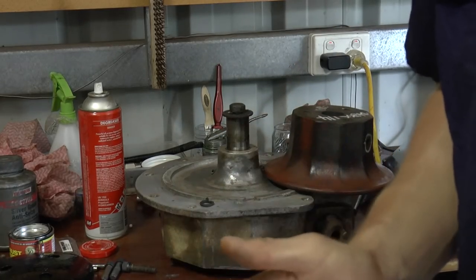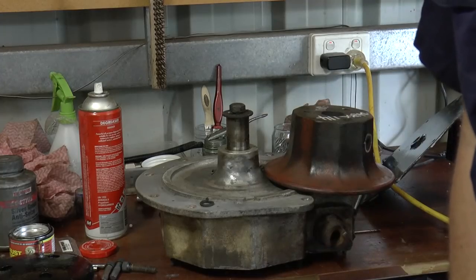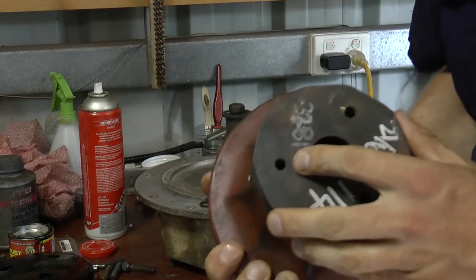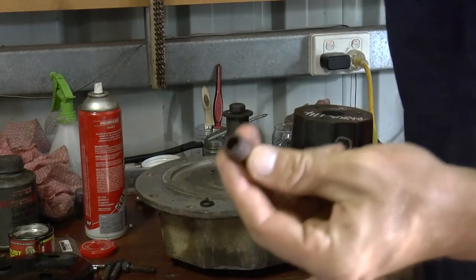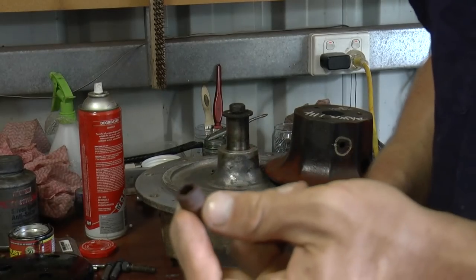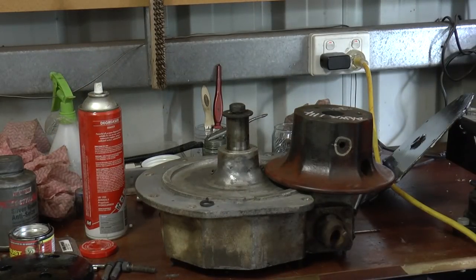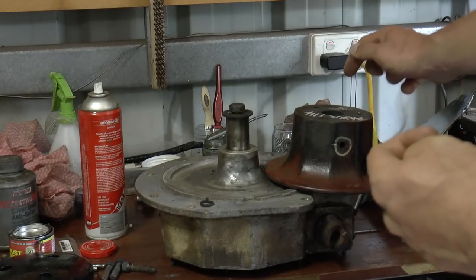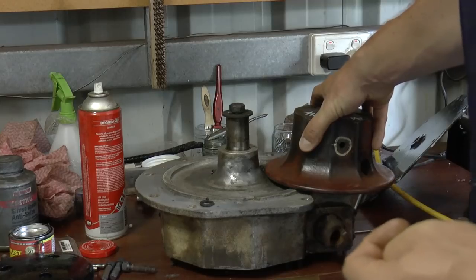It was taking too much time so I had to delegate it out — when you can't fix something, delegate and relegate. So I took it to Alan at AL Welding, a very gifted boilermaker. What he actually did was he welded a nut to the actual head of the bolt itself and had a go at trying to get the thread out that way. It actually broke the welds — that's how hard and how seized it was in there. That took a week to actually get the bolt out and then drill a hole to get the bottom part of the turret off.